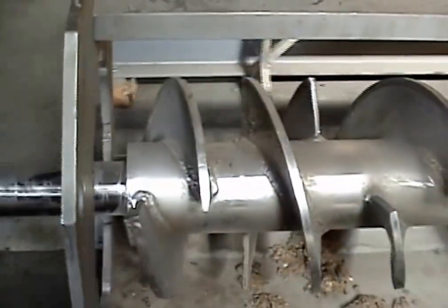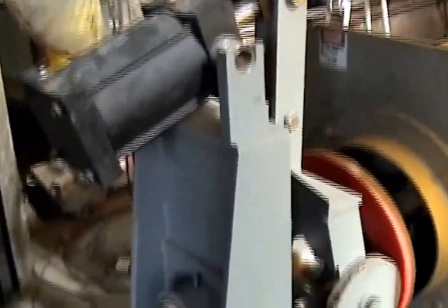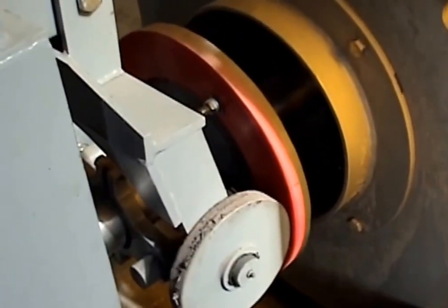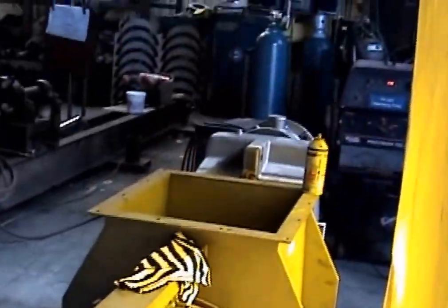Screw has a fairly big diameter shaft. Anyway, a more conventional, newer design machine. Air cylinder mounted on a pedestal with a support bearing. These wheels pushing that discharge cone. In here you can see the screen, the screw. There's the outside of the screen, inlet hopper and gearbox.